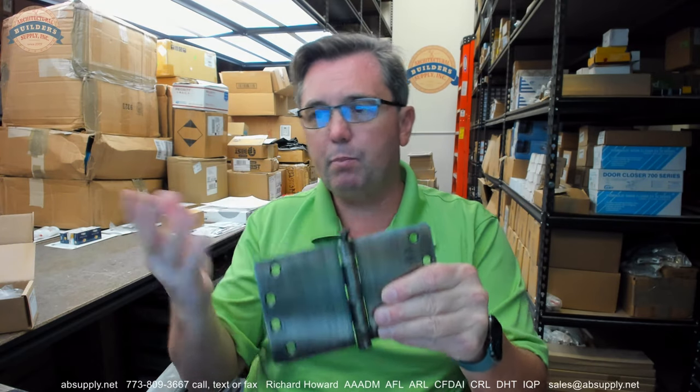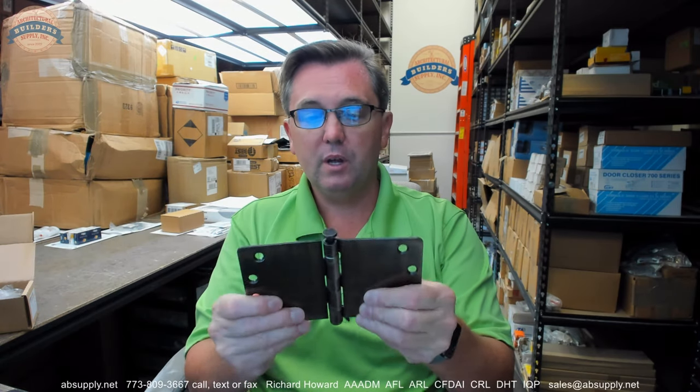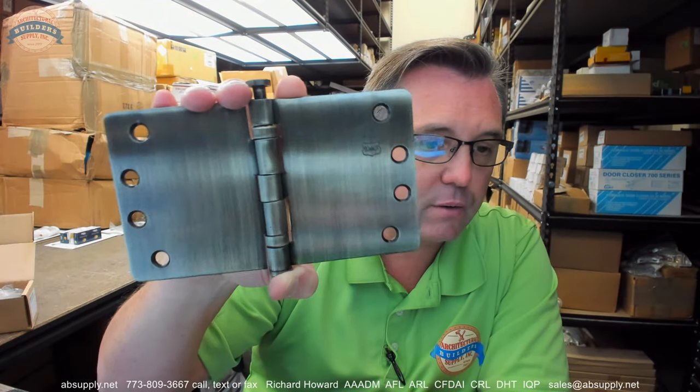This client's application was ball-bearing or no ball-bearing — purely residential, where usage would be quite small. If I recall, it's a dining room to a hallway, so those doors are going to hardly ever be cycled. The difference between plain-bearing and ball-bearing won't be immediately apparent beyond the cost difference, but 20 years down the road every hinge will show some wear. For doors used more often — like a basement door, garage door, or exterior doors — that's when the payoff really comes with a ball-bearing.